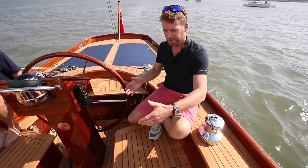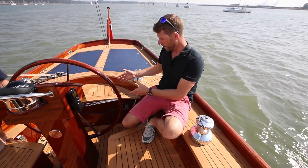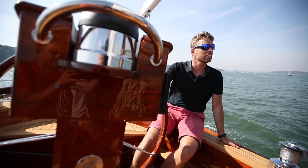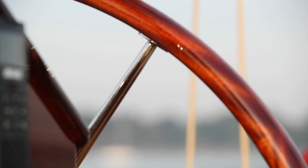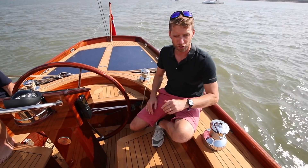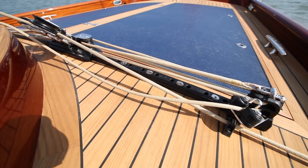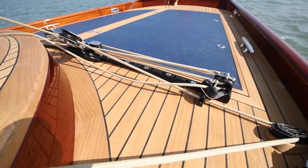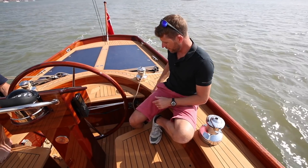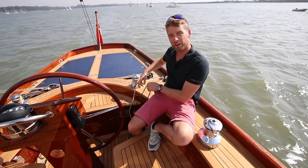You've got a deep, secure cockpit with coamings all the way around, and a really well thought-out helm station. You've got a nice big wheel that you can comfortably steer from either side, either coaming. The coach roof isn't that high, so you've got a good all-round view whichever side you're on. The mainsheet is on a traveller aft of the wheel, and that comes to these two Lewmar 40 winches, which you can operate while on the helm. And down here you've got the adjustable backstay with a purchase below the deck.